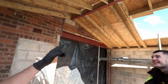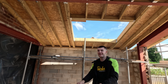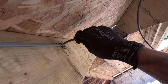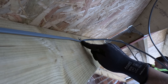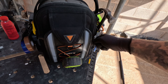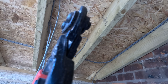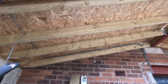Right, let's shift all these over. I have to pull them back. Luckily we did it - we're better off bolt cropperring it. We'll snip it and bend it out because they won't come out any other way. What we did to make sure we didn't get any sag - because one mil with the DeWalt cable stapler, no matter how hard you push it, you'll always get some movement - so we hit it with a hammer afterwards so it didn't slip. Moved it up half, so it's still 75 centimetres apart. Now we'll get them clipped up.